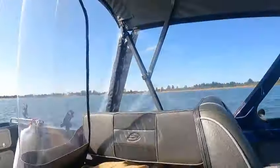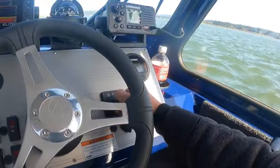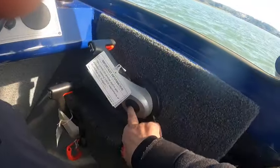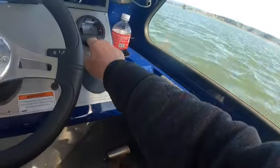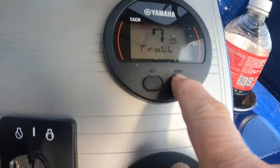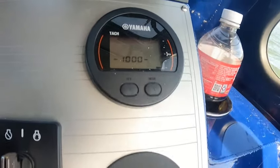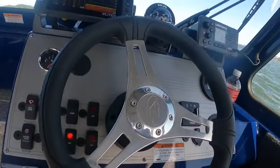See there you go, always chatting. So anyway, go back to this — turn on the key, put it in gear, lift up on the lever, neutral. Same thing — when it's there, push in. Now this has got BTS too, so I'm going to put it in gear, hit the set button until you see a 'T', then hold the mode button until you see 'troll.' Then keep pushing — it's 50 RPMs. I can get up to about a thousand. There's a thousand RPM — we're doing 0.3 miles an hour.